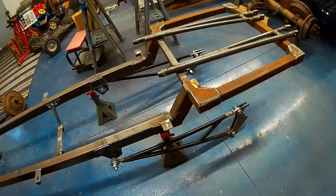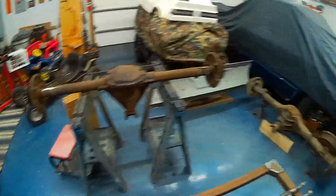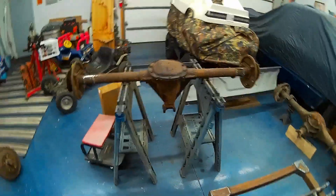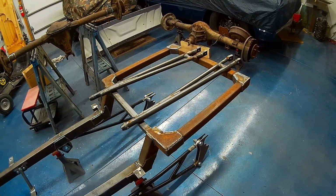Mounted the ladder bars. Now what we're going to do is we'll finish the cleanup a little bit here, get the big chunks off, clean up where we're going to weld. We'll set the rear end and set a panhard bar. So that'll be our next video.